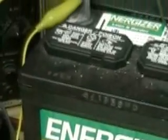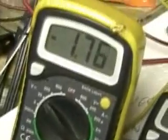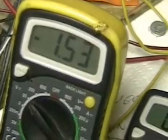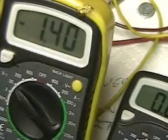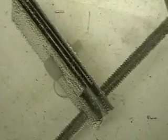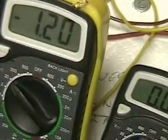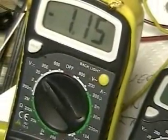This is going to be the last time I visit this. One of the reasons I'm showing this again is because when I did the test before, I have to admit it wasn't quite nicely done. I've disconnected the power and I'm going to show you how the capacitance stays with the plates. There's no amperage now, and here's our voltage on the plates only. The plates have been separated from the battery and you can see we're getting a little action there — not much. We've disconnected the power but what we're looking at is the voltage still left in the plates: 1.1918 volts, going down at a steady rate.